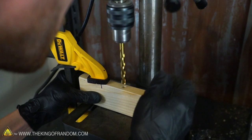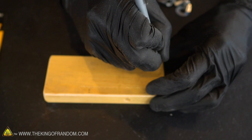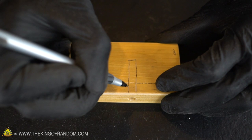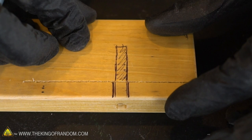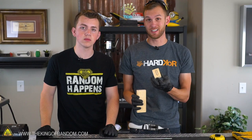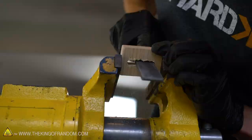Here's the basic idea: we drilled a hole that goes all the way down through the block — it's one quarter of an inch wide — but because we don't want the all-thread to bind on this part, we then drilled a larger hole wider than that quarter inch. This is our 5/16 inch hole, so we have a wider hole through the upper portion and then it narrows down to one quarter inch for the lower portion. This means the all-thread should bind really well to the wood in the narrow section but float in the wider drill hole up top, which is good because we need this to move just slightly in and out. Now for the sliding piece, we need to drill this long oval-shaped hole — we want it to float and slide back and forth — so we'll use the 5/16 inch drill bit, drill holes down in sequence making a tunnel through the wood, and clean it up with a file if needed.